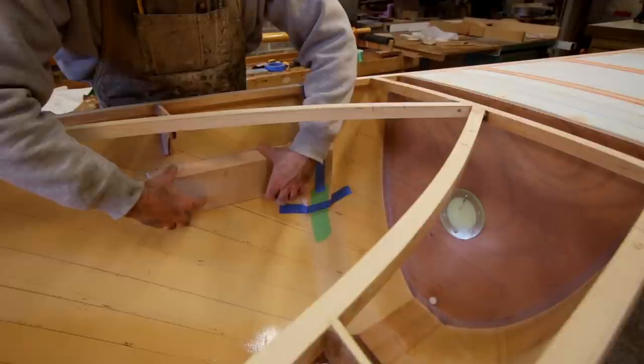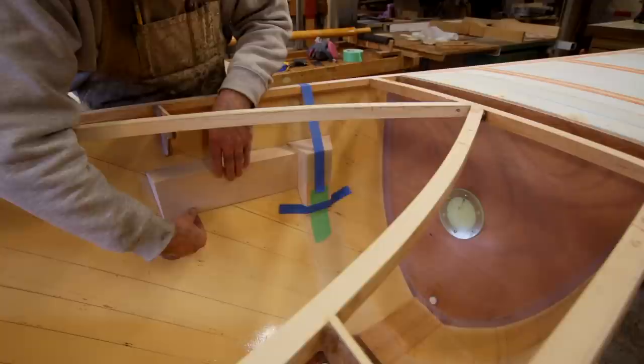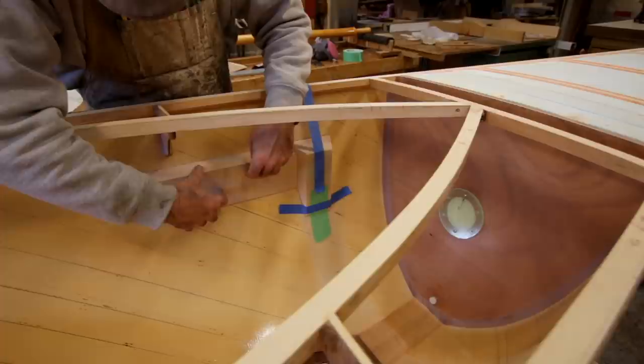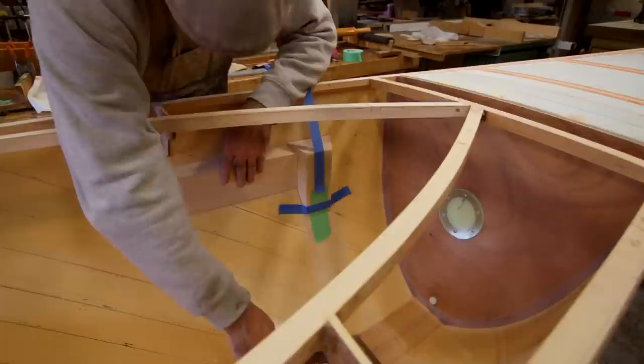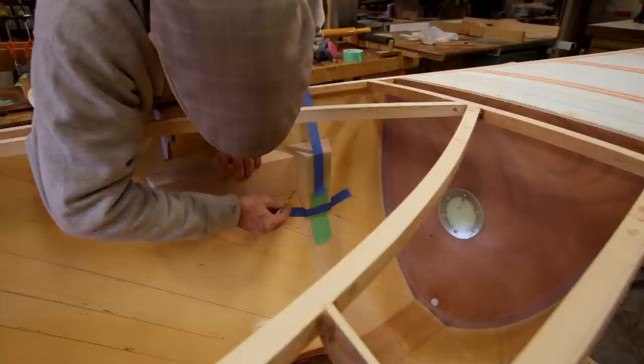And now I've got to figure out how I'm going to clamp that, and it'll pretty much be the same thing. So I think I'll try using a tape hinge down here. Although this comes to a feather edge, so tape hinge works well here, it doesn't, so that's a bit problematic. Not sure what to do. Maybe I can actually tack a batten down here, a piece of door skin that's going to carry the lower edge. I think that might be worth trying. I'm just going to give myself a mark showing the underside of this. There we go.